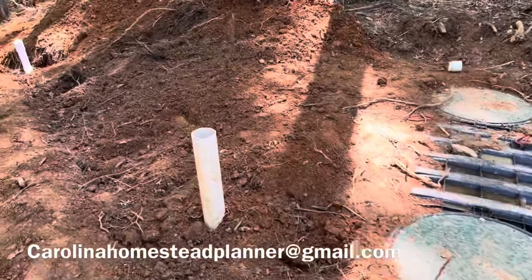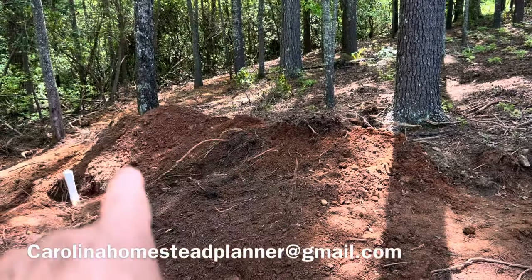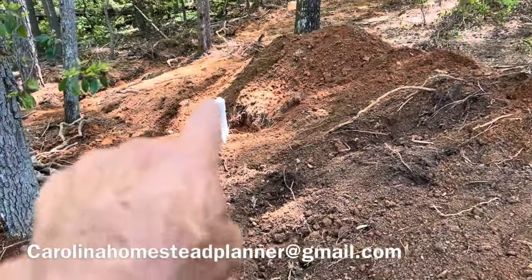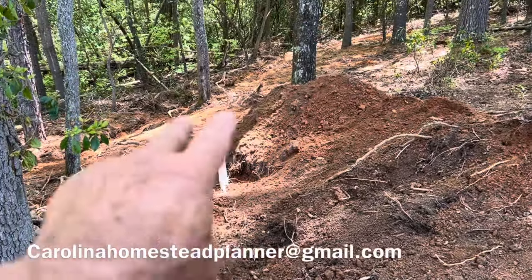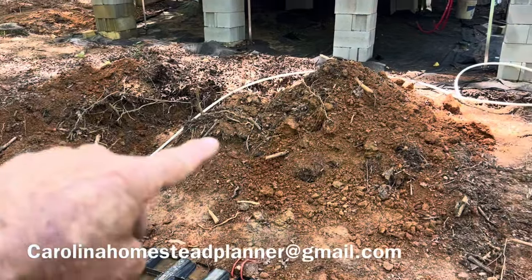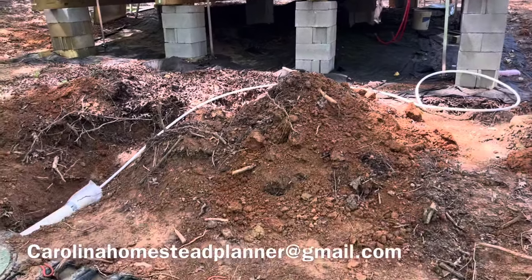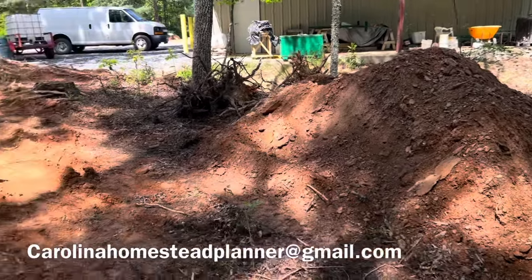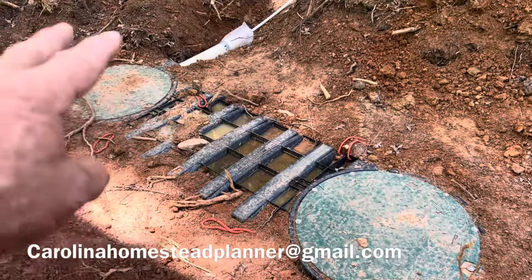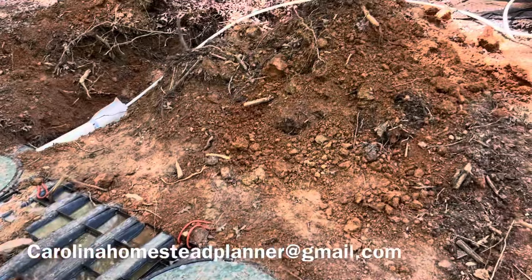Crazy Shovel Will has been backfilling here. I took the tractor and pushed some of it down but couldn't get in here with the trees. Finally got the last piece of pipe and put this clean-out riser up, and we're trying to get this all filled in before the weekend. Our next big project will be digging the sewer line in and I'll show you how to get the grades right to hit the septic tank underneath the tiny house. That big pile of dirt will go on top of the septic tank, and we'll mark the lids with a couple of pavers on top so somebody will always know where it is to get the lids off and pump it out if it ever needs to be.